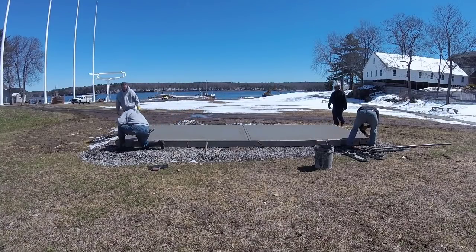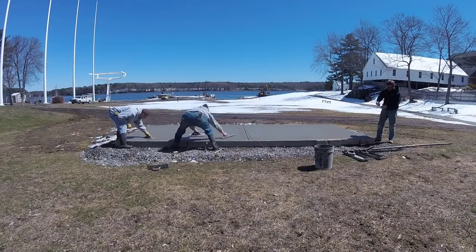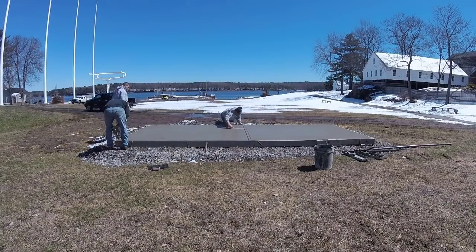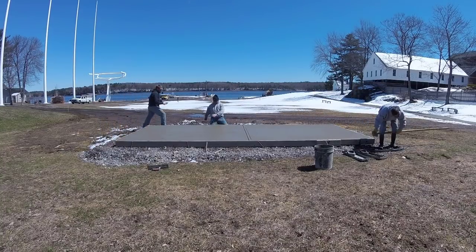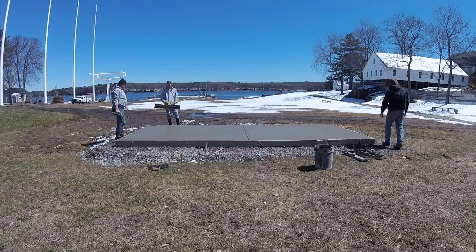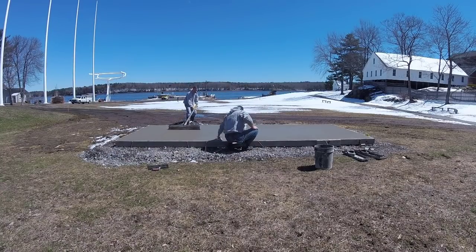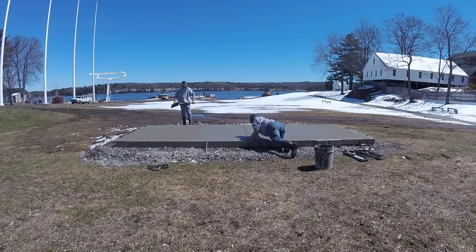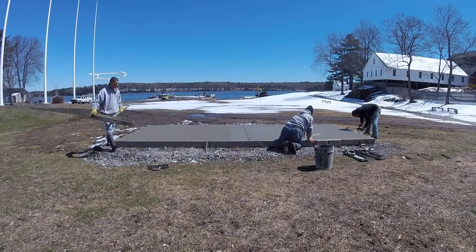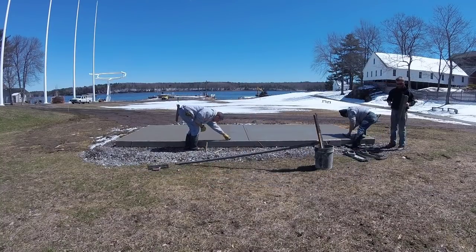My other guy is starting to mag the surface. We always mag the surface first before we broom. Even though the slab is already pretty smooth from the bull float, it still has a few little imperfections, so we mag the surface, get all the imperfections out, any little rock holes, and that brings up a finer cream. Our concrete up here in Maine — because we have so many freeze-thaw cycles — has air in it; it's air-entrained concrete. So we only mag it; we don't steel-trowel any exterior concrete up here. You always risk sealing the surface off too early if you steel-trowel, which could trap moisture or air and lead to blistering or delamination. Maging doesn't seal the surface off.